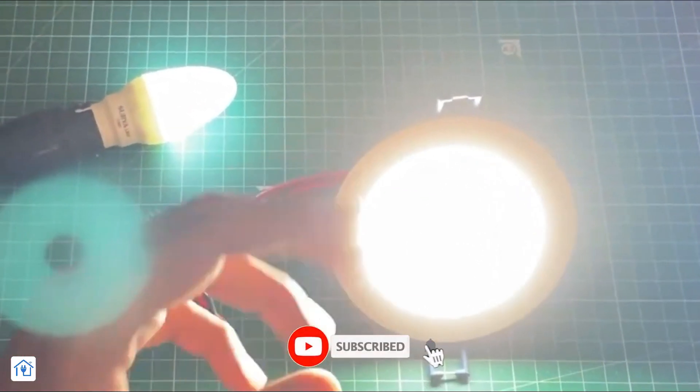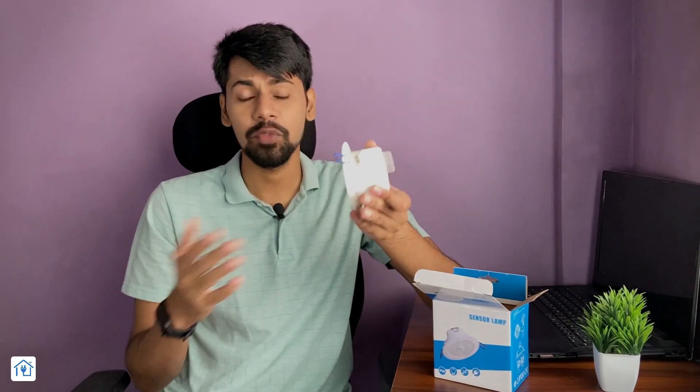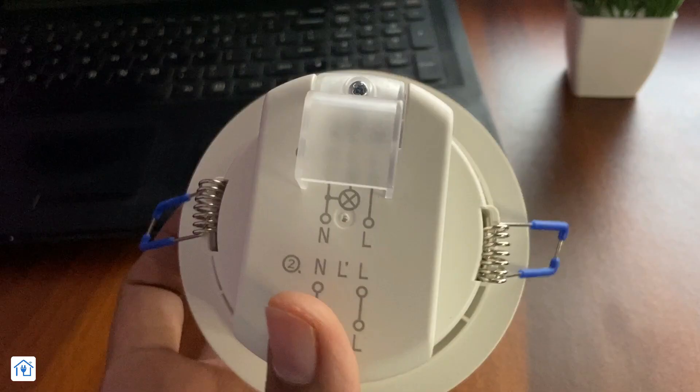The lamp will turn on when motion is detected. Now the very special feature: it has an inbuilt lamp, but you can also connect an external load of up to 500W. This makes it a very perfect product for staircase lights. If you use just two units, you can connect a total of 6 lights. One is the inbuilt light, and you can add two extra lights per unit. If you have 20 steps, you can cover them with 6 lights.